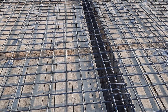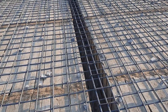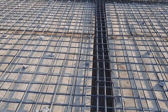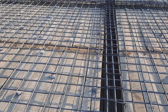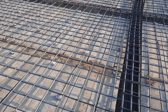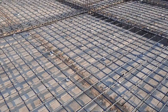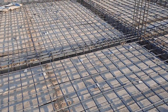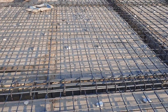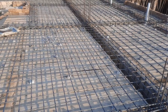You can see the floor beam is on one side — looking at the left side and right side spacing, you can see this is not proper steel reinforcement in the construction of this floor beam. Also, at the left and right sides there is no concrete cover, so after completion of this structure the steel will be exposed to the environment from the internal side of the commercial or residential building.